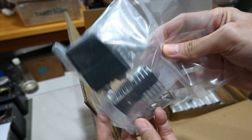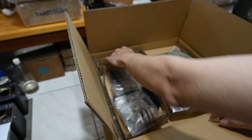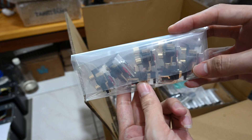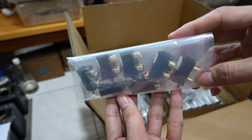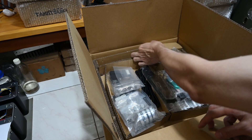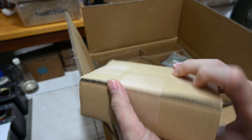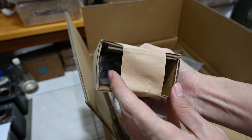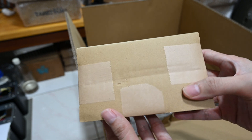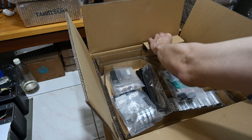And some other stuff — tube sockets, some heat sinks, some plastic connectors, nothing really new. And then we can see RCA sockets for the PCB — nice ones, though maybe I won't be using all of them. The other item is the Alcor transformer. I haven't opened it but I trust it's the same as the old one. The Alcor transformer is rated at about 50 volt-amps — not so much, but should be quite okay. Good quality components.